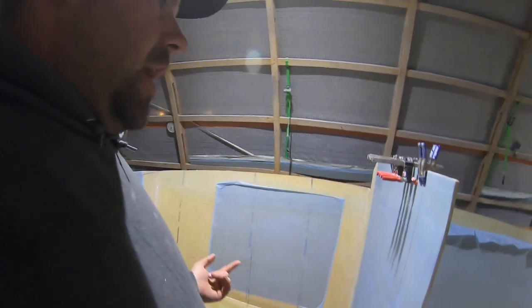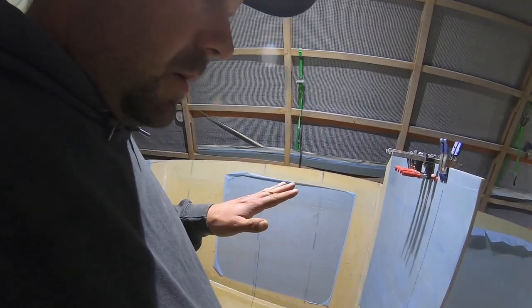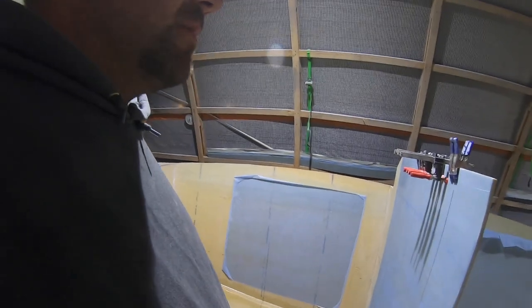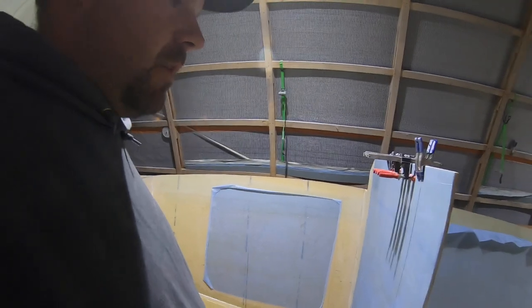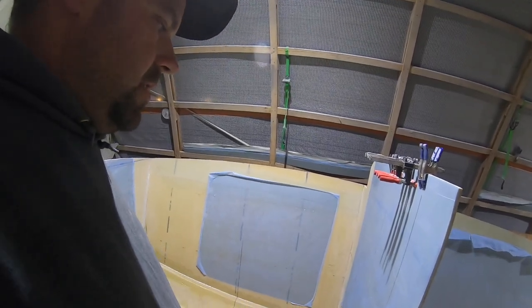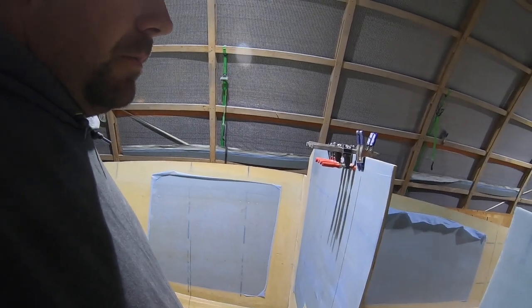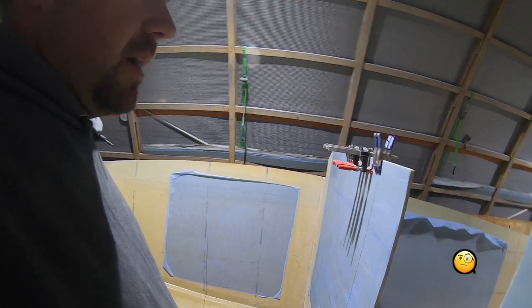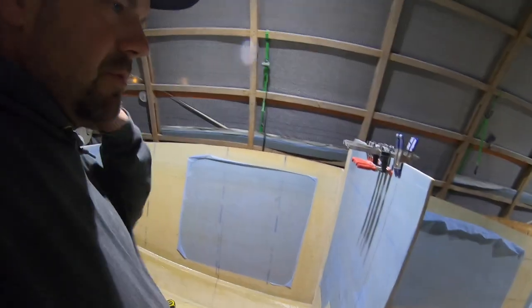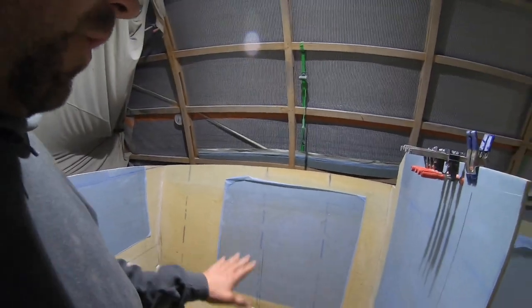and we want to foam fill the hulls of the boat. To do so, basically, if we fill up to the designed waterline with foam, theoretically that should create enough buoyancy to float at any given time. It sounds right in my head, and I'm thinking it's right. So again, I'm going to go around. I'm just going to mark the water lines.